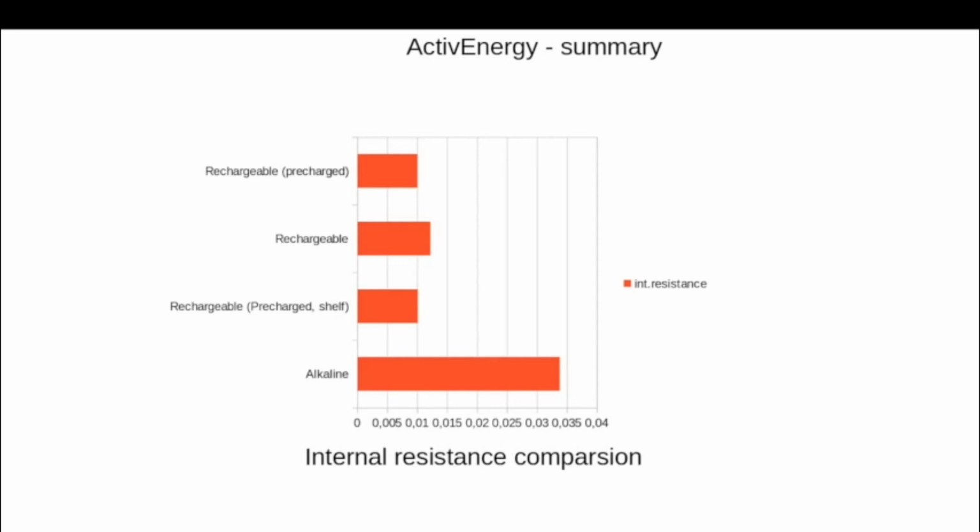So, for example, your digital camera can say, okay, the battery is drained, I will not work anymore. And you take those batteries from the digital camera, and they will work in a flashlight, for example, or with some toy train, and they will work for some time. Why? Because they are not fully drained. They just cannot deliver high current, in short.